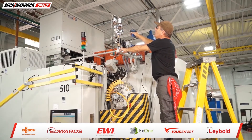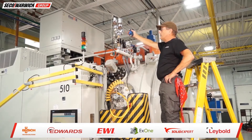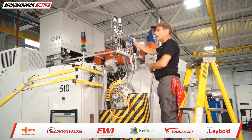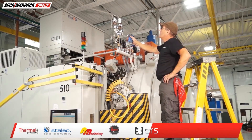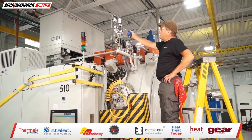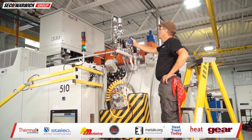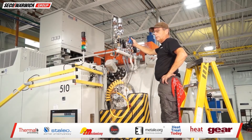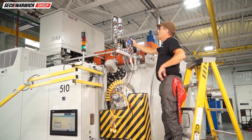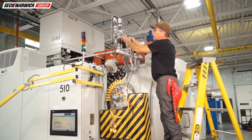Those flanges we're checking basically just have an O-ring in them. If the gauges were removed for calibration, there could be a mistake when they were reassembled. These are probably going to be okay, but you still have to go through them. I won't wait the normal three or four minutes between each check unless we actually find a leak, then I'd go back more slowly. There's also contamination during the heating process — outgassing from metals or oils — which is why we have pigtails to protect the gauges. Those vapors can work their way into a gauge and give a false reading, which is the whole reason many people have them calibrated. These gauges are only good to slightly above atmosphere, so we have a cutoff valve installed that shuts to protect them anytime it goes over atmosphere.